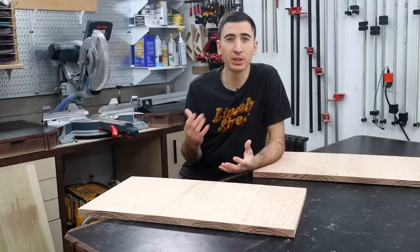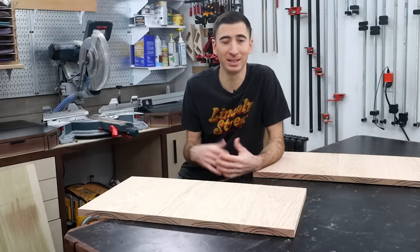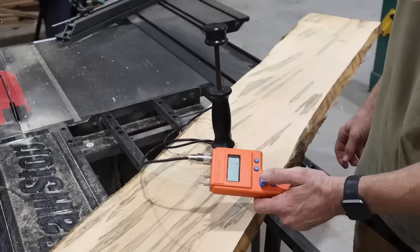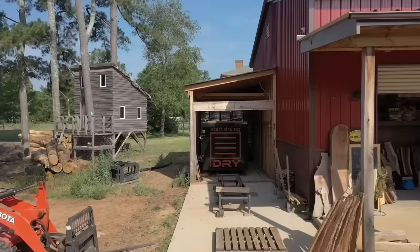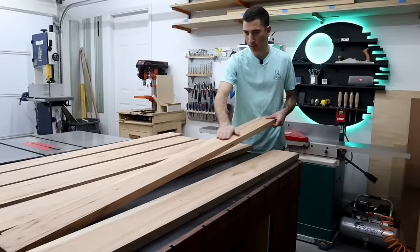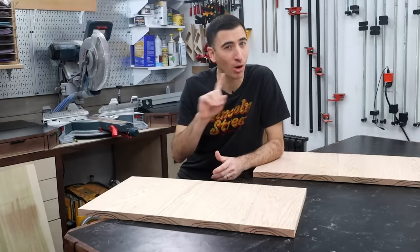This is one of those tips that just gets passed around as gospel. I have no doubts it was much more relevant 150 years ago, when furniture was stored in homes that weren't properly sealed and didn't have modern HVAC units to maintain consistent humidity. There are still instances when I abide by this rule, like when I'm making a thinner panel that won't be supported. However, for the most part, if you use lumber that's been properly dried with correct joinery and your piece is equally finished all over, it's really not a major concern. So put your best looking boards face up!